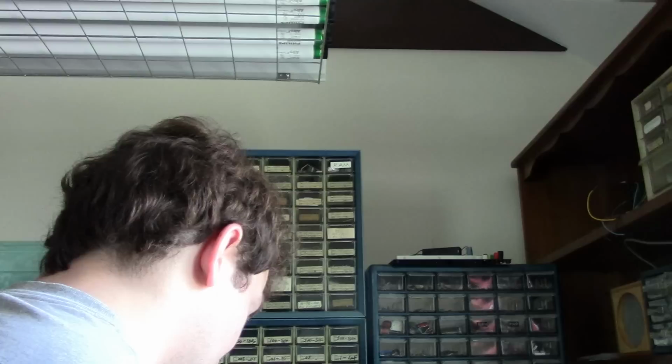So anyway, with that, I was able to make not only recordings with other microphones, such as a Sony F96 Dynamic, but also direct recordings of music. And the quality is a lot better, although somewhat muffled on treble frequencies because of the slow speed of 1 7/8 inches per second.